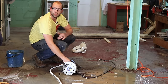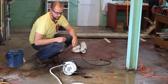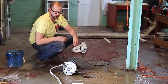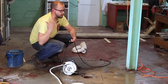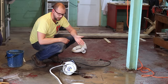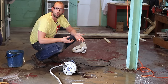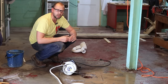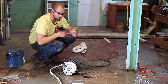I would say this blade actually worked really good. You could tell it was kind of pushing back. The amount of water it took to keep this thing relatively dust free was a lot more than I thought — I really had it flowing pretty good, otherwise it would just poof dust everywhere. But it seemed to cut great with really no change in performance from beginning to end. I would bet you could make quite a few cuts with a diamond type blade like this.